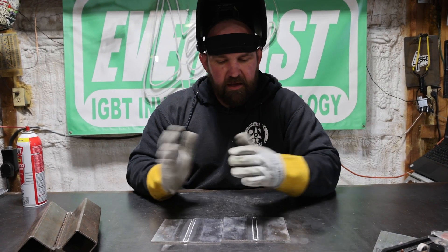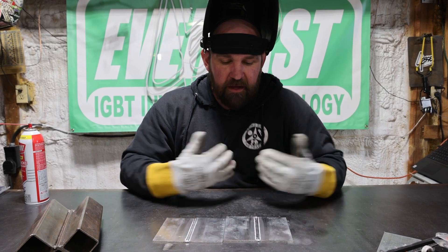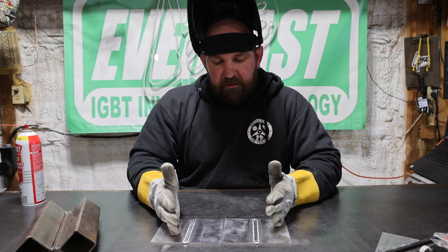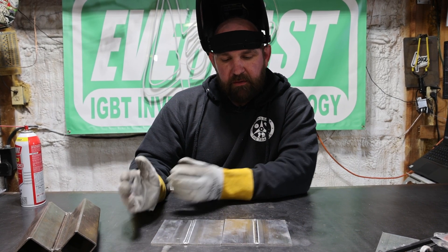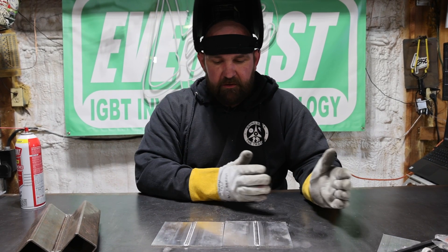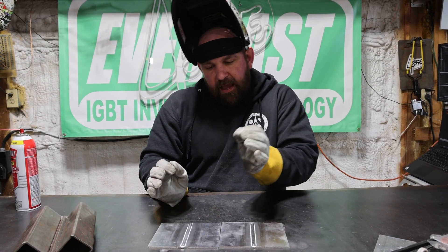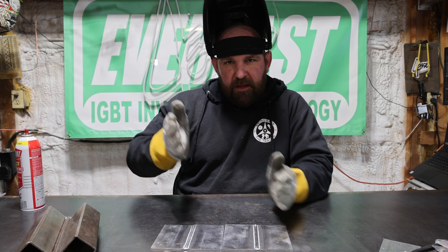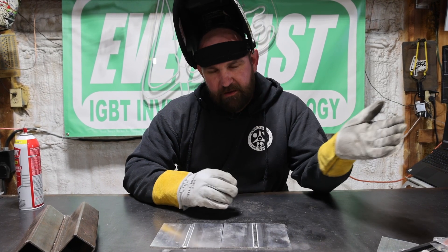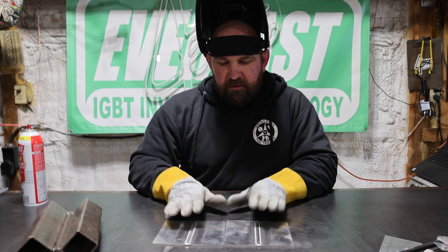The point isn't about gas lens versus standard cup, or gas flow and tungsten size — this is about technique. I've got a lot of years running aluminum, and that's what most of my videos focus on. Even as I'm running these welds, I'm not really thinking about what I'm doing — I've run it so long that I can anticipate from the bead what I need to do. I can run two drastically different setups and know while welding that I need a little more torch angle, more filler rod, or an increased arc length to set the bead. That's a lot of information to unpack and we could do a five-hour video just about how arc length affects your bead.